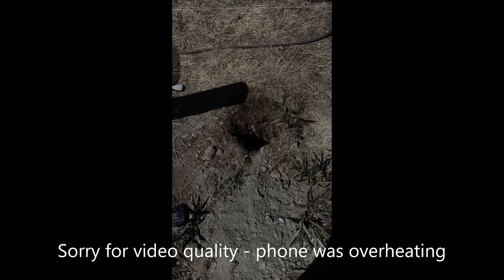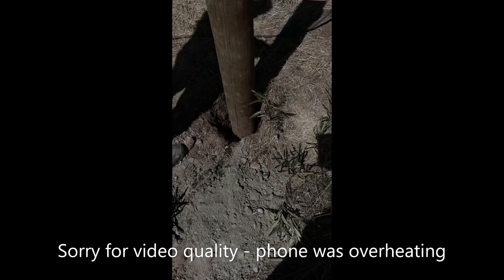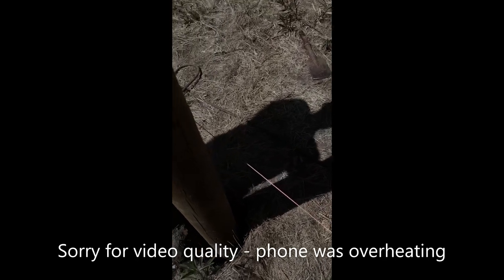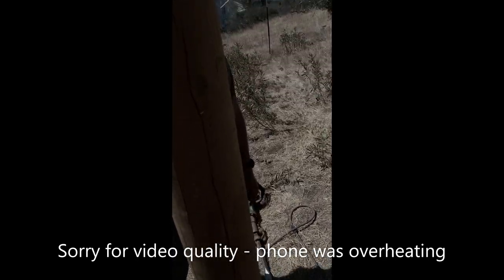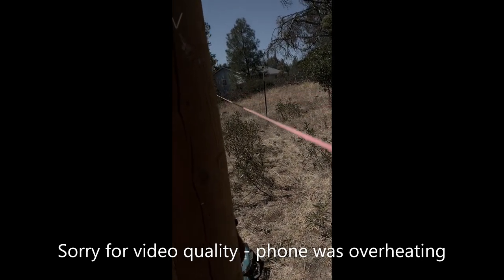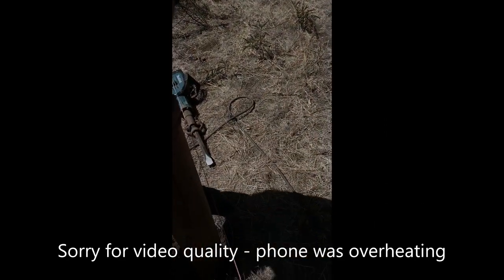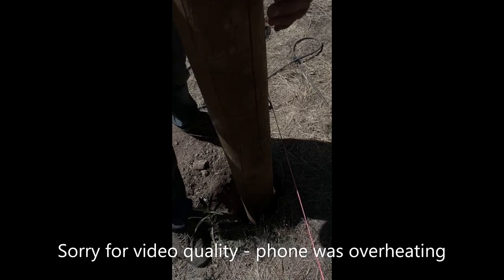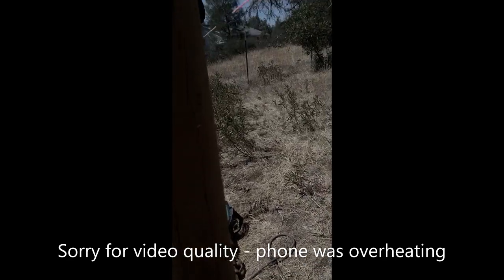So the thing we do is double check and make sure our hole's straight. So line up against my string. So you look in the hole, I'm as far forward as I can get. I'm touching the bottom string. Look at the gap. So that means I got backed up a little bit, which I should be. I told you about the cone effect. The deeper you go, the more your hole narrows. So that's as far as I can go.